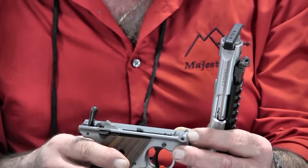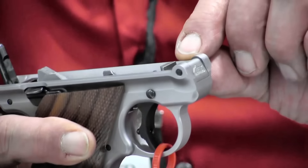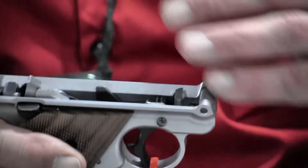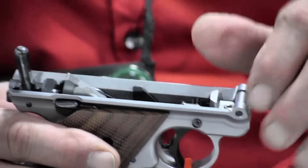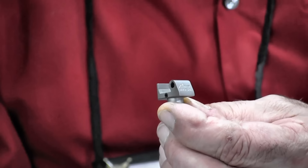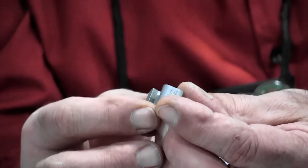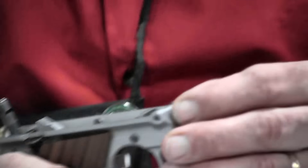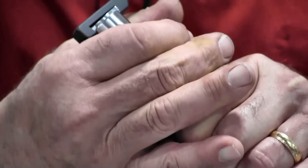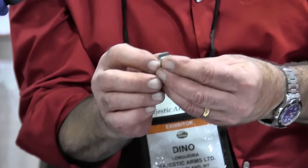You want that to be a nice tight lockup — that's the key to a quality double or over-and-under shotgun. What Ruger has right behind the hinging area is a removable part called a frame lug. They put a piece of rubber in there and when you close it, you're squeezing and compressing that rubber. I thought that could be better and was afraid the rubber would deteriorate — and I saw it happen already, the whole upper half developed some play. So what we did was we duplicated the frame lug but we call it a locking block. Instead of a piece of rubber, we've got a stainless steel threaded column with two locking screws, one from each side. The customer drops it in with an Allen key, adjusts that center post until he puts nice light contact and pressure on the upper. So now when you put them together, you get that bank vault locking. When you're happy with the adjustment, all you need to do is tighten the two set screws and you've locked up your adjustment.